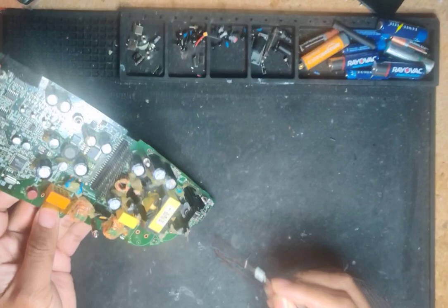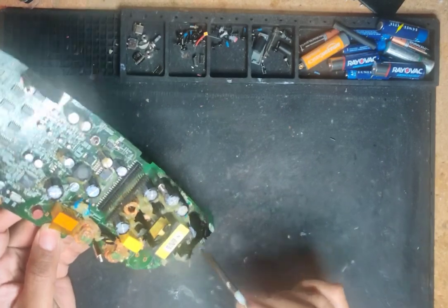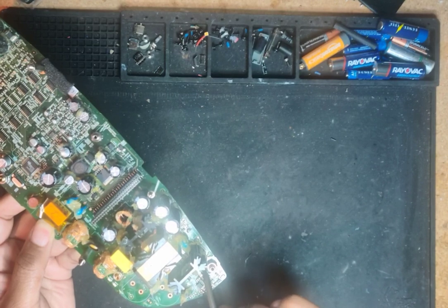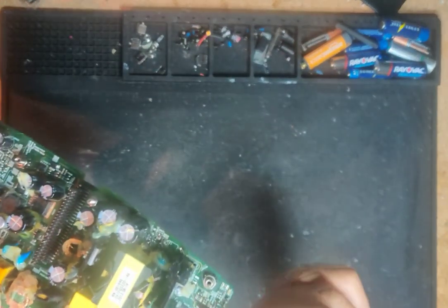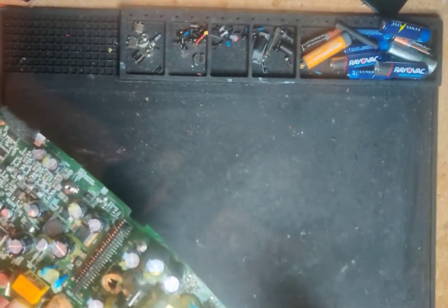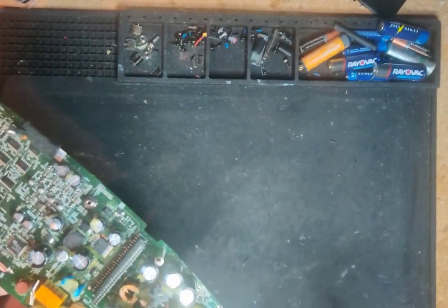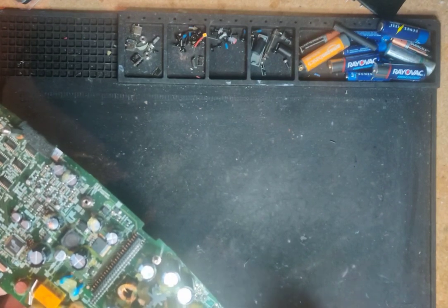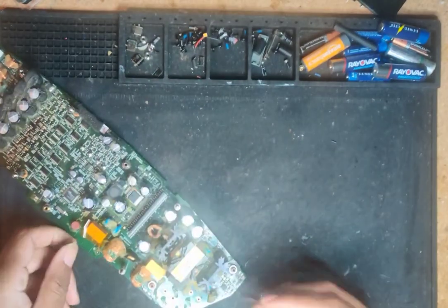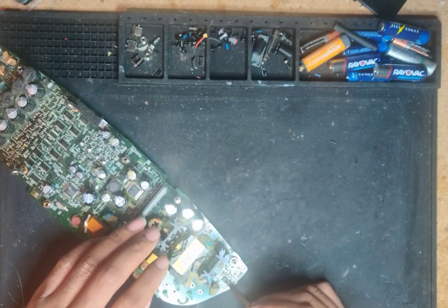Right behind this tall capacitor is actually the switch transistor, but there's also a resistor — a 10-ohm surface mount resistor. When I tested it I was reading mega-ohms through it. That resistor is right next to this tall component, and it was supposed to send the signal back to the chip to keep it on once it started — but it was bad so it was never regulated.